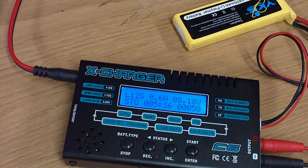It'll do up to six cell LiPo's. It won't charge those very fast, but it will charge them. Two cells, it can charge up to six amps. It can do pretty much anything at up to six amps — LiPo, Lithium-Ion, LiFe batteries, NiCd, nickel metal hydride, and lead acid.